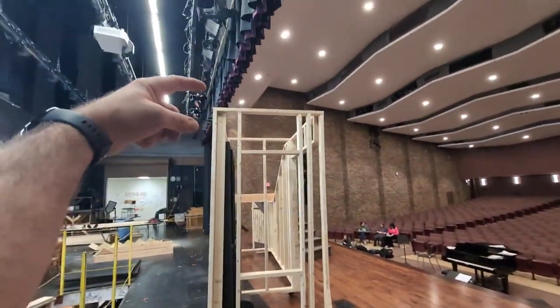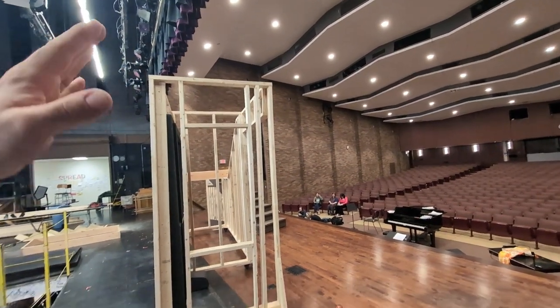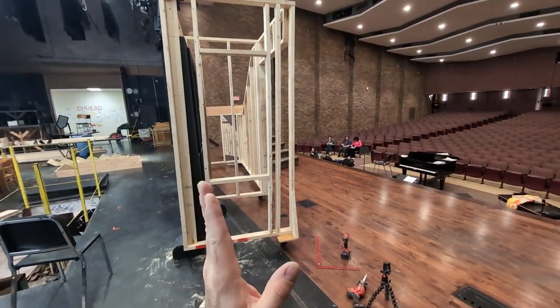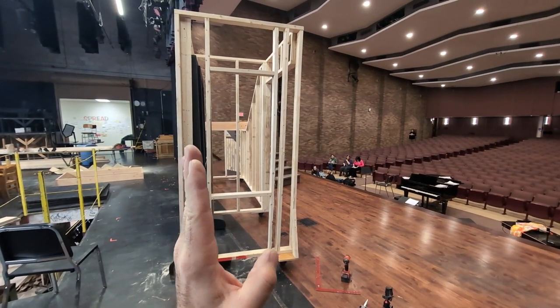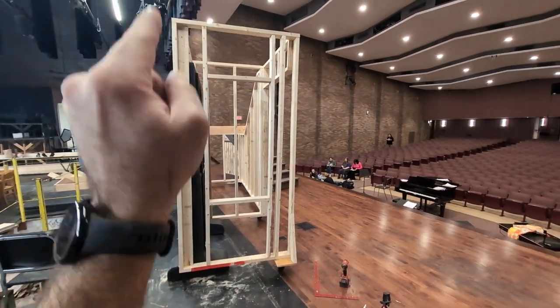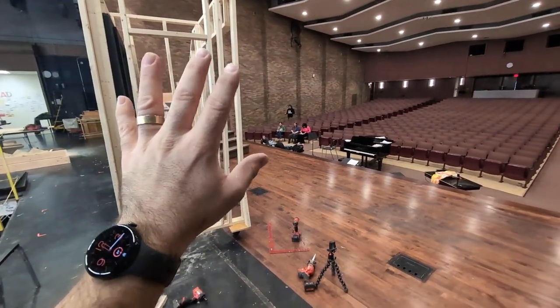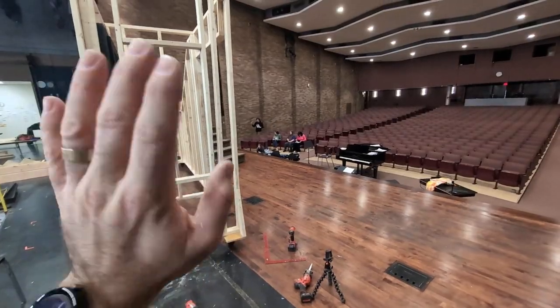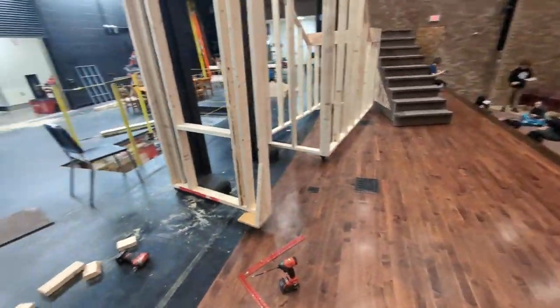Use the Luan, I'll attach the Luan, you'll notice when I do it, I'll stick it across the top flush, and then the side will hang down, and likely because this thing is racked that way, it'll expose, and then we'll just rack it until that straight factory side lines up with this, and then we'll tack it down there, and then we'll proceed to find some more framing here to hold it all flat. And then I'll just plunge and router out this window hole. And like that, we'll have structural integrity and we'll have it skinned for the most part.